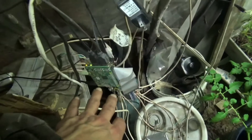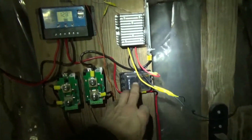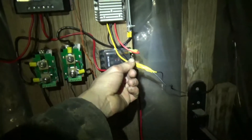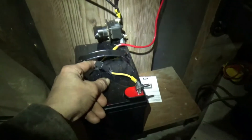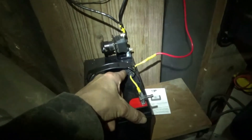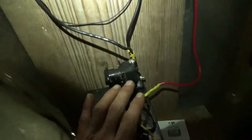Later on, when I get the other upgrade boards on the Pi, we'll be wiring that in through the bus. I'll probably put a 5-volt output fused bus here for the output side of the converter so it can be fused on both sides. The system is connected right here with a 30-amp fuse right at the junction, so if there's ever any major short, it kills power immediately so we don't have a fire.